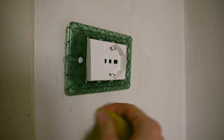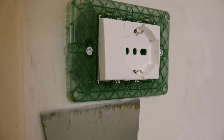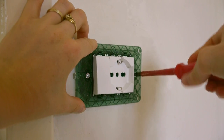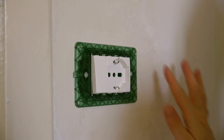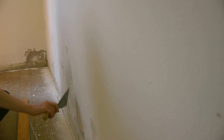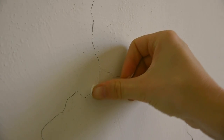After a first layer I smoothed it down with a damp cloth. You can also use sandpaper but this produces extra dust. And the wall is completely smooth again. The bottom of some walls had a bit of damage which I covered with some plaster paste. Also the cracks were filled with plaster.